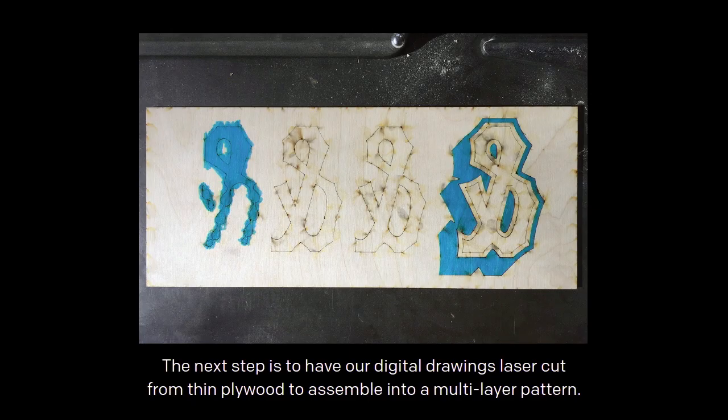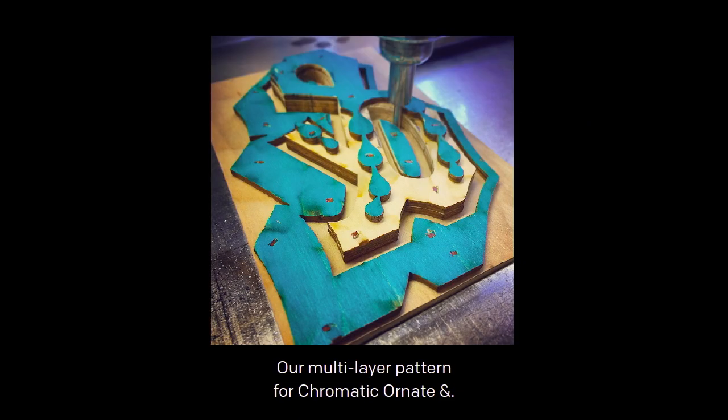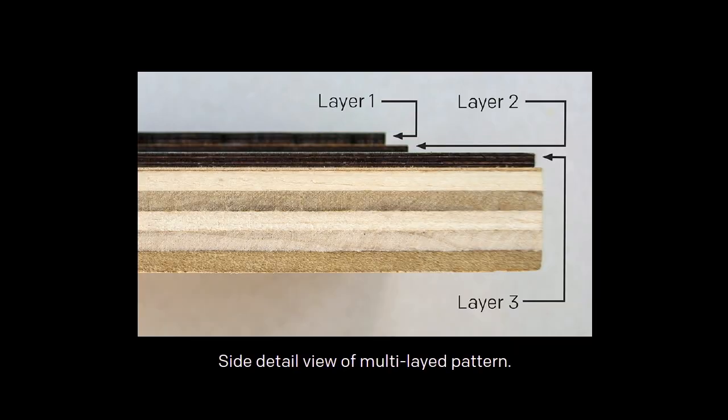Here's just some of how we went about it. We cut many of the letters to be able to build up the height on the pattern. There you can see, I don't know whether you can see the different heights, and I also have it displayed here. Those are all the different layers that we have. I've learned a lot about making type after making it for so long, and about the ratio of the size of the pattern to the size of the type we're making. So we only make the chromatic in one size, and it's based on that.